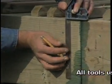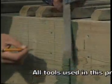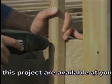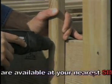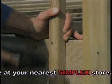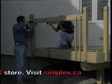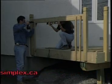Trace the corresponding lines on the skirt using a T-square. Then, screw the balusters at both extremities. This will allow you to attach the rail right away. Securing the rest of the balusters will be much easier. Then, fix the rail to the posts, on the sides and underneath.